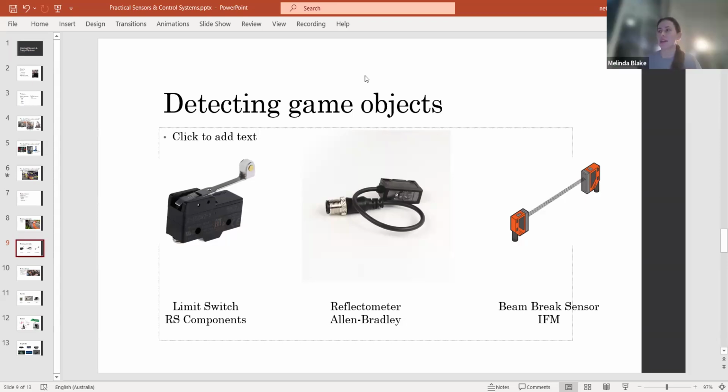No, definitely. Like you were talking about elevator position earlier, we used Hall effect sensors on elevators where we didn't need to know precisely where it was. We just needed to know when it passed through. I think it was 4 specific points. And for that application, we thought that Hall effects were really good. And then as long as you can get the magnet at the right distance, they're pretty easy to use as well.